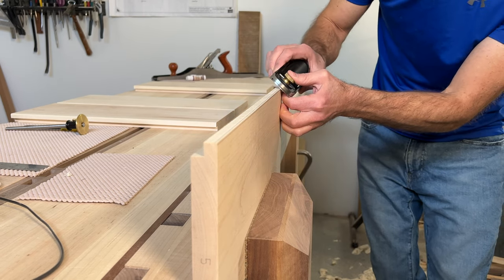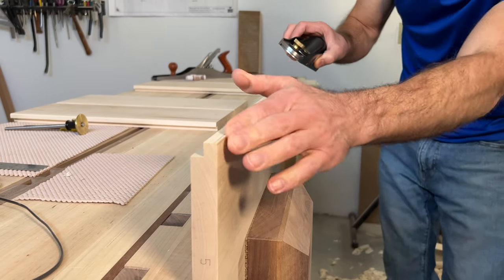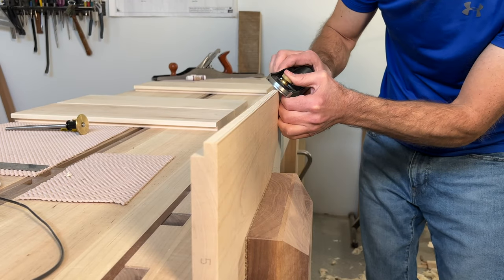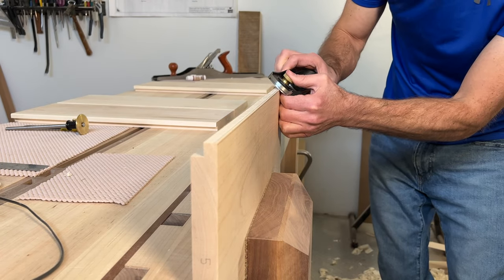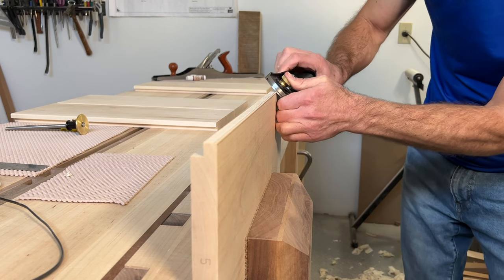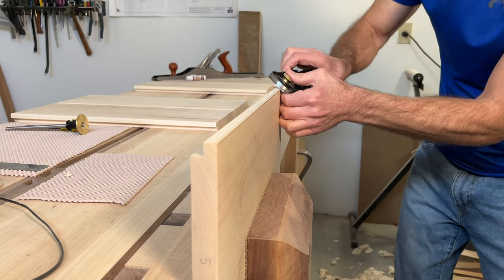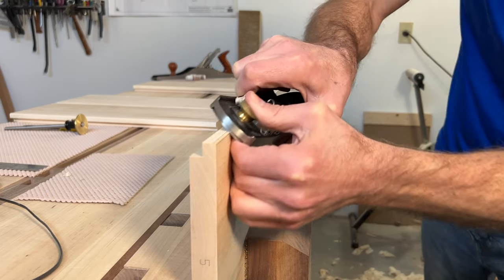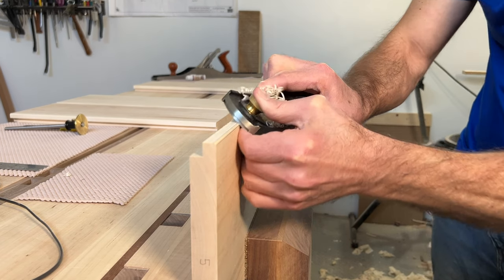Let's run down here on a 45 degree angle and skew it a little bit to hopefully avoid tear out. It didn't feel like it tore out, but it may take two or three runs down the board before we see that happening. I'm using my index finger against the face of the board as a bit of a fence to maintain the angle all the way down the length. Looking at the edge, I don't think I'm getting tear out, so I'm going to continue working to those pencil lines until they just disappear — and we're almost there.